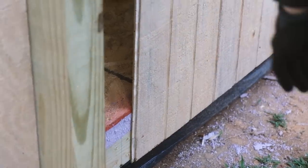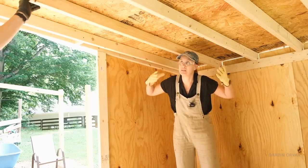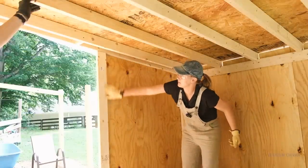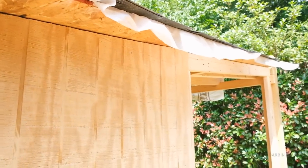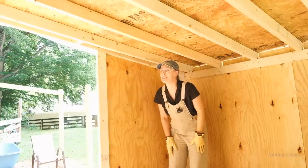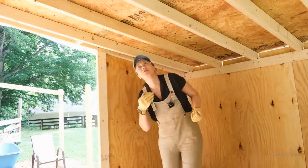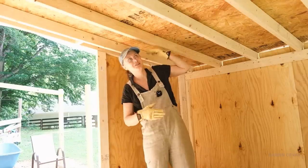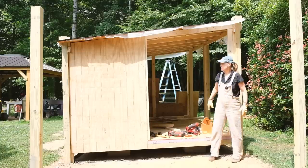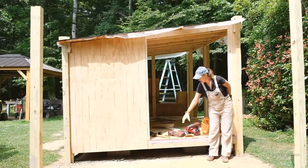The walls here are just kind of hanging off the structure — the ceiling is not carrying a lot of weight. We added a support piece right here resting on this beam. We have these crenellations cut out, and we're actually going to cover the ceiling with beadboard. One of the reasons for that is because we have nails coming down from the roof shingles, so to cover those and so you won't hit your head on things that pop down — it will all be the same ceiling height. Right here is where the door is going to be, so we're framing up for the door next.